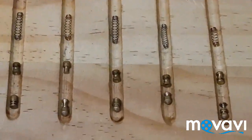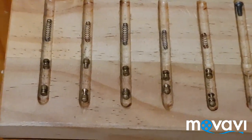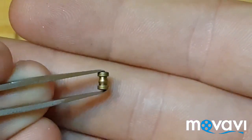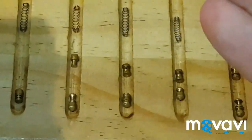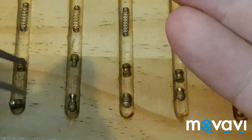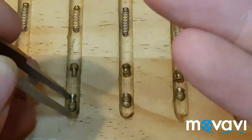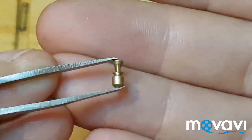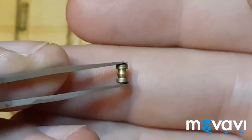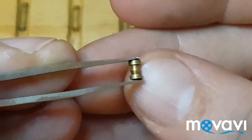Let's take a look at the pins. We have a sort of spool with a wide bit in the middle, and the key pin, threads on the key pin, absolutely awesome work on it, very nice T-pin, and also a little thread on it there with a spool action going on, same as pin 1. I wonder if that's the Lock Noob's Christmas cracker pin, because it looks a lot like it.